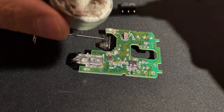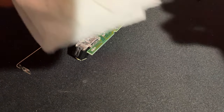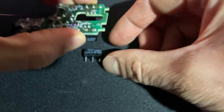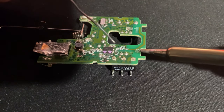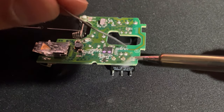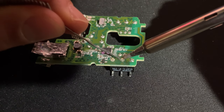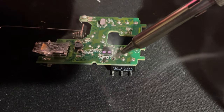So we're going to go ahead and solder in our new switch. First apply some tip tinner on our soldering iron, and then what I like to do is just have a wet rag and then quickly go over the iron. Then we'll go ahead and place our new switch in here. I'll use the old switch to prop up the new switch so that we have a flush fit. All we'll do is just heat up the pin with our soldering iron with the solder flow — one, two, and three.